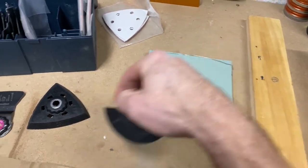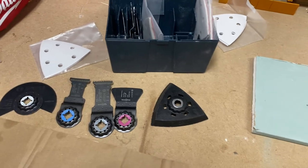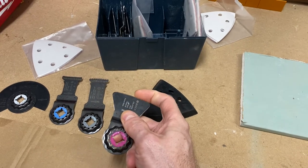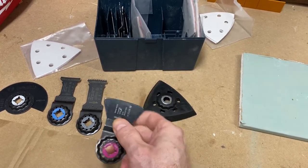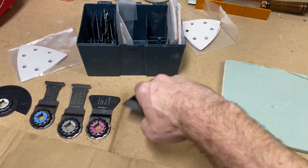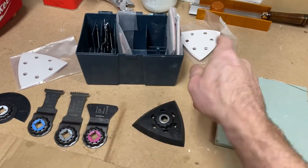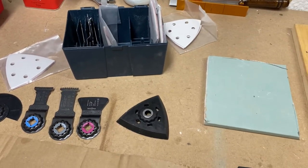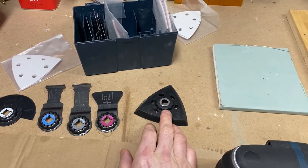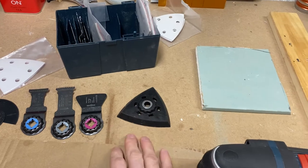For the shorter ends of a drywall cut you can use the carbide blade or that smaller-tooth blade, so it's a very handy blade to have. There's also a blade for soft material — if you're trying to pry up adhesive under floor tile, this will shake under there and get it out. Then the other attachment is a sander pad, which came with wood pads and paint pads, so you can sand wood down, sand paint off wood, and they also make pads for removing rust and getting thinset off the back of tiles.